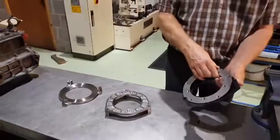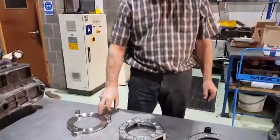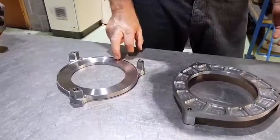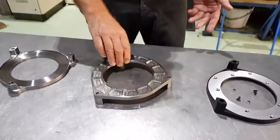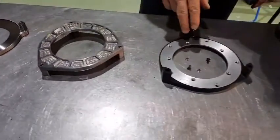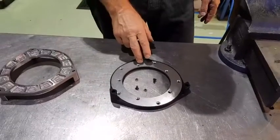What's the difference in the weights between the three of them? We'll quickly look at the weights. First one is the Ultralight steel EN8 — they're 1.32 kilos. This is the EN24T, which is 0.87 of a kilo. A lot lighter. And this one loses another 130 grams over that one, which is 740 grams.